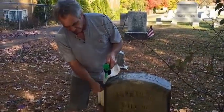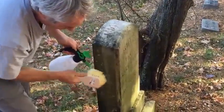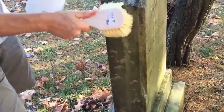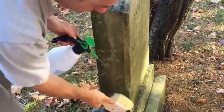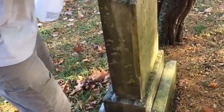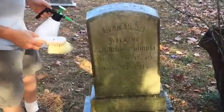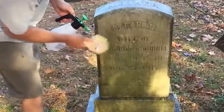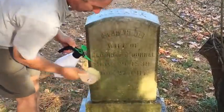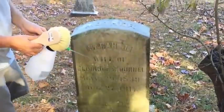Come over here — this is cleaning up quite nicely. You can see this heavy discoloration. Not all of it is going to come off in one shot immediately; it's very built up. We're under a tree here, and this stone may never have been cleaned in a hundred-plus years. We'll check the date on it in a moment. We're going to give it a little final rinsing and call it done for now, letting the D2 work on its own since it's pretty well worked its way into the stone. The cleaning will continue for the next few weeks to few months as a general rule.